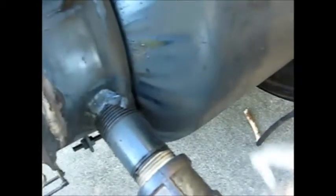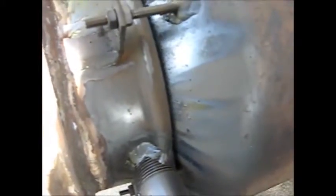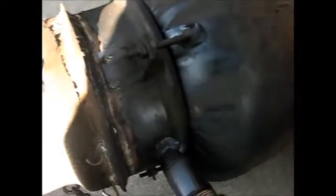As you can see, there's some tar buildup along the top edge of the barrel seal. You can see where there's some leakage of wood gas and tar that came out from between the hopper and the fire cone. I'm thinking that may be the problem — there's some leakage there that needs to be welded or sealed somehow. Whatever that seal is, it has to be high temperature.